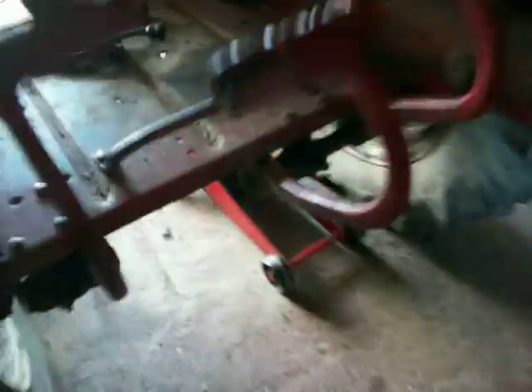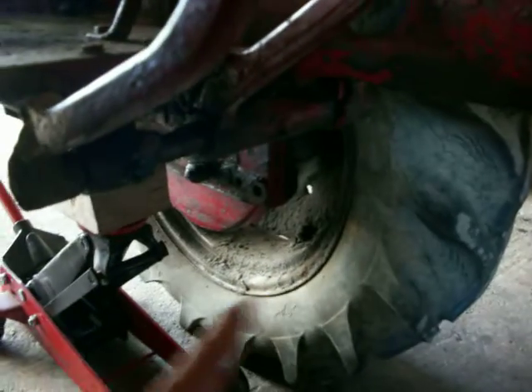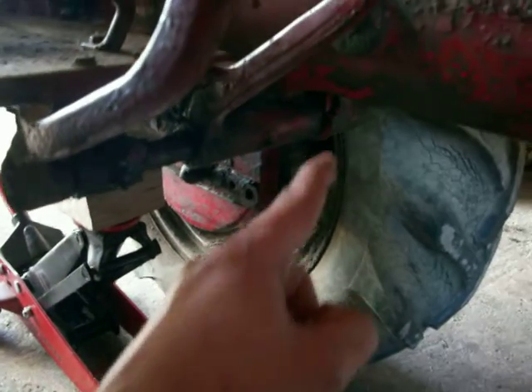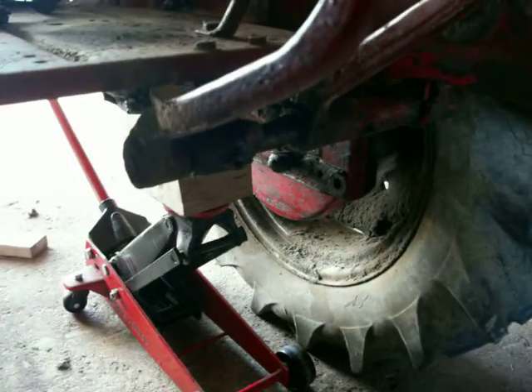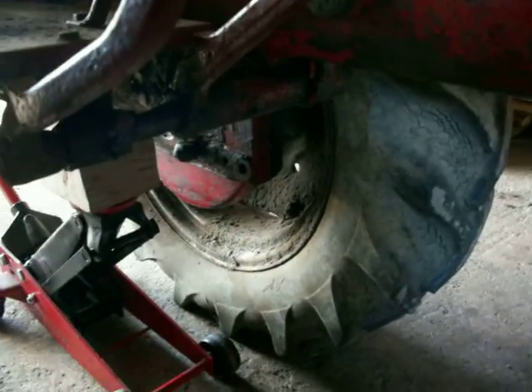Pull off this brake pedal, hammer the head off, and run the shaft through. So the saga continues — next we're going to get a torch, heat this up, knock this piece off, pull the tire, slide the shaft out, and replace the bushing in the frame. Maybe replace some bushings in here, then put it all back together.